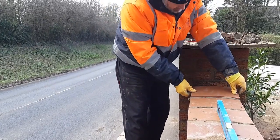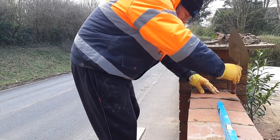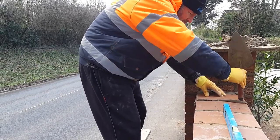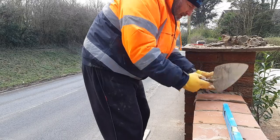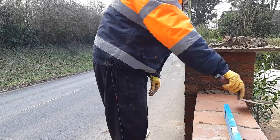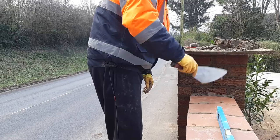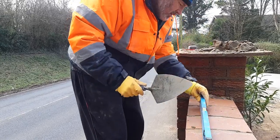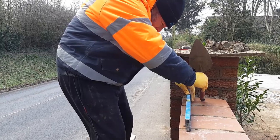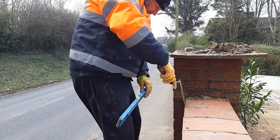Just squeezing it in. You can see all that now — all the perp joint is coming up, billowing up, coming up the side — so that's further showing us we've got a nice tight joint here, full and solid with sand and cement. And then just level that across.